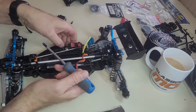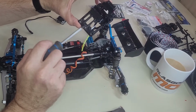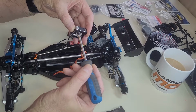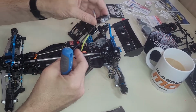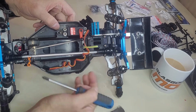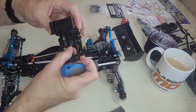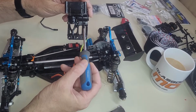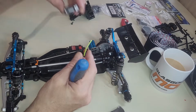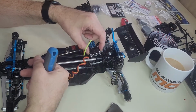So what you need to do, say, is first remove part of that and part of the screw on the replacement part. I've completely done away with that. Half remove that, and to move it down a bit better, I'm thinking of grinding the corner of one of them off just so I can seat it neater. What I'm planning on doing is making it a lot neater, because all I've done is tapped an M3 hole through the plastic, and it's only held on by one screw. So I'm planning on doing four, either mounting some captive nuts underneath, or same as that really. There's that. Kind of making the wiring tidier. I'll say it's not really that neat, so I'm going to try and make it more factory. And I'll see how I get on.